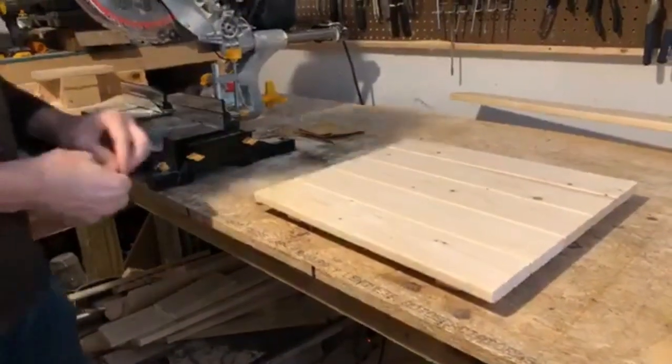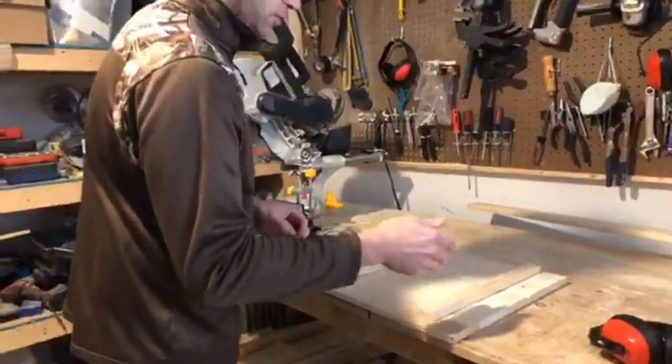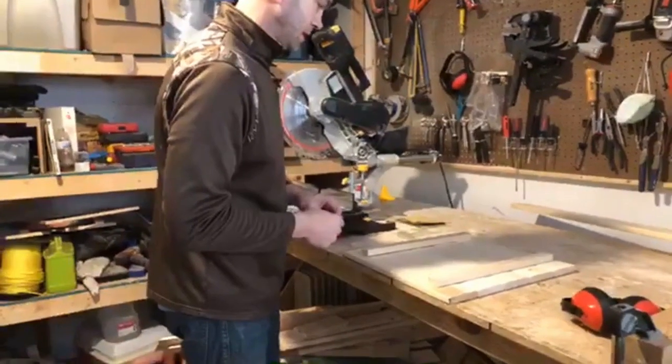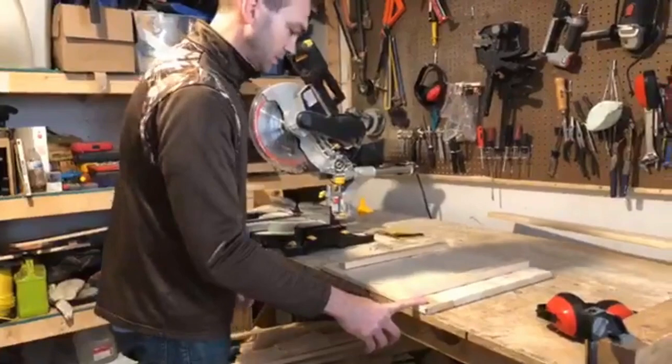You can use 1-inch screws if you don't want to mess with hammering, but it's going to be 20 screws per pallet, so you want to factor that in. A thin drywall screw would be enough for this soft wood. It wouldn't be a big deal.